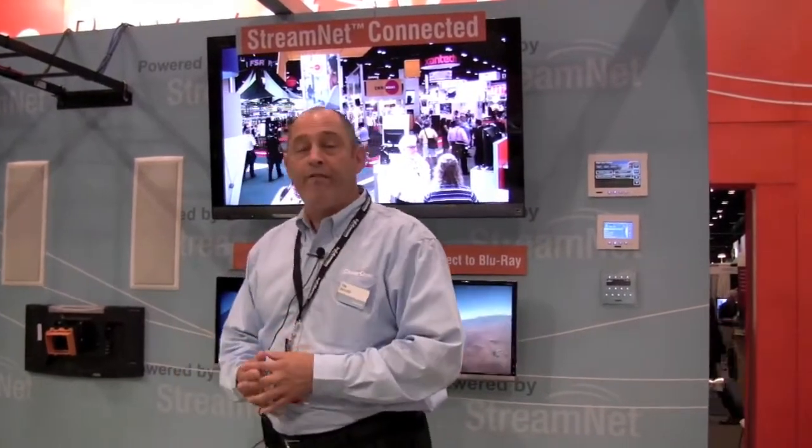And again, one of the big features of our system is we give you GPIO where you need it, at the edge of the network. Every single one of our devices has RS-232 and IR control, so you can control head-end devices as well as television devices. We pride ourselves on being able to write drivers for just about anything. If you have a project, say, that has a new model of television that has an RS-232 control on it, we'll write a driver for that.